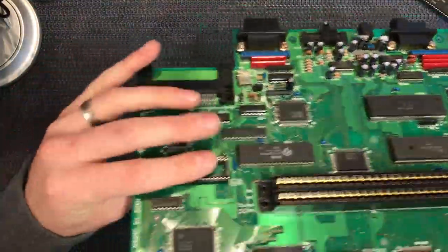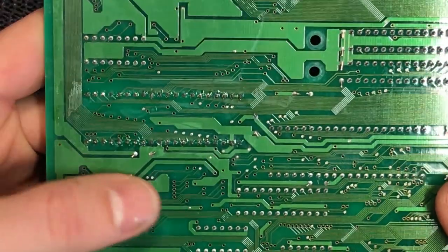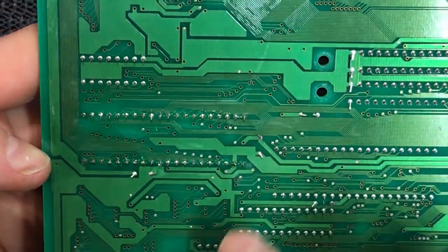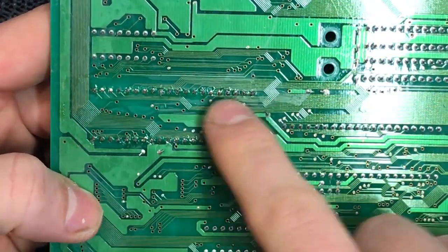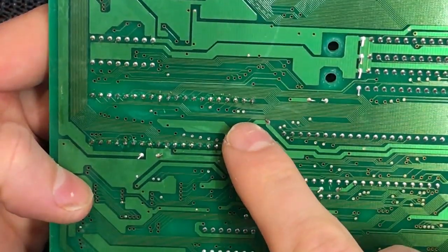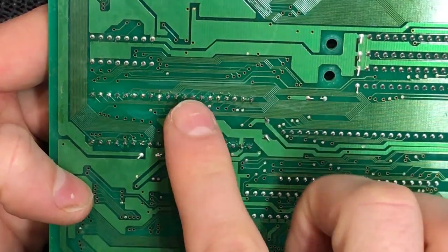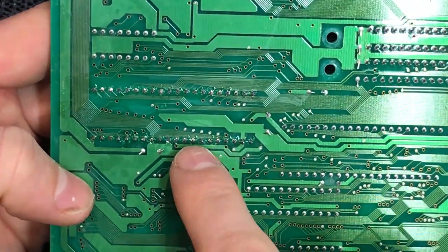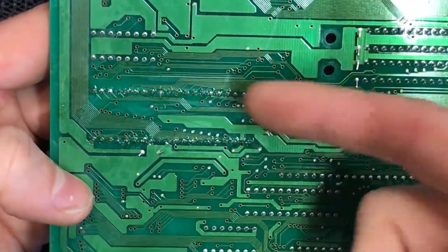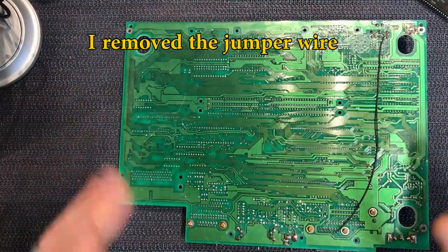But what we're interested in is the underside of this socket, really. So let's have a good look at that. Yeah, there very well may be some issues on this solder work. It's hard to tell. I can do a few continuity checks and see if they actually run down and are actually joined together. Especially through this region here, it doesn't look very good. It could be flux, but I'm seeing a bit of contaminant on the surface there. If it's just flux or if it's solder, I'm not sure at this stage, but we'll have a good look at that and I'll check out those pinouts and see what that actual jumper wire is doing. So let me just do a bit of research and I'll come back in a sec.